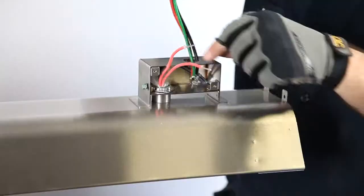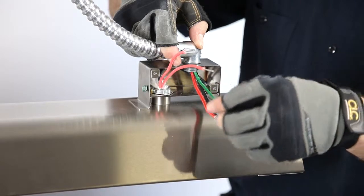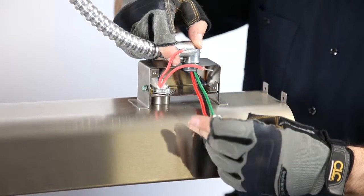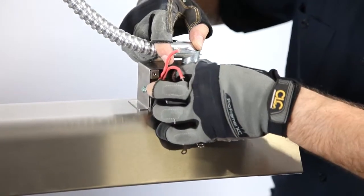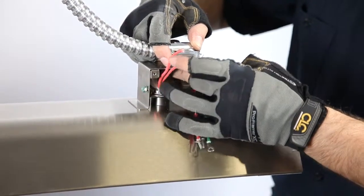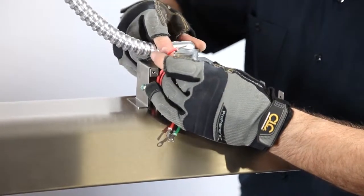This will be connected from the outside junction box to the J-box of the heater. After drilling a hole into the upper half of the containment box, run the whip from the outside junction box into the pocket to be ready for the final electrical connection. If necessary, you may obtain longer-length high-temperature whips from Infratech or your distributor.